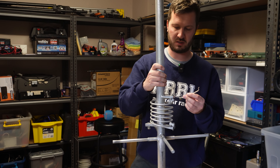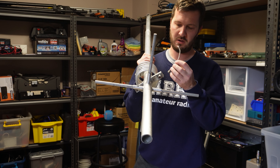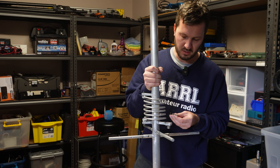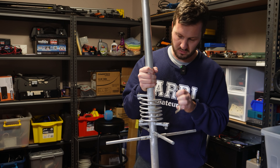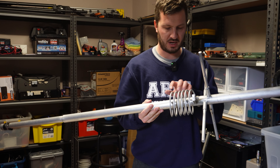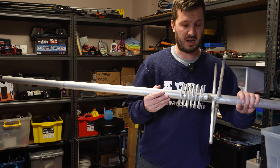One of the issues I also had was the tap-off point. You'll see here on the bottom of the antenna you've got an SO239 connector with a little tap-off for the coil. What had happened was it had developed some corrosion - it uses brass and I hadn't sealed it very well. So I just need to re-solder the connection back on here, and I've cleaned up the tap-off point which I've marked on the coil. I've also double-nutted the main vertical radiator to the base to make sure it doesn't come loose, because this flexes quite a bit in very heavy winds.